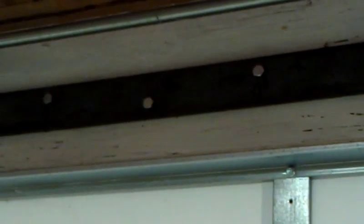So onto that I installed, with half inch lag screws five inches long, a three quarter inch by three inch steel bar bolted all the way across the 16 foot garage door. Also put one on the 7 foot garage door. That took the bow out.